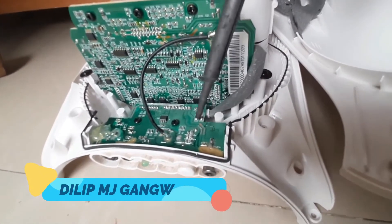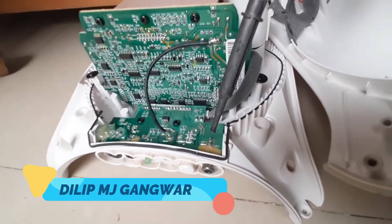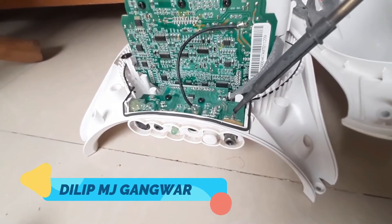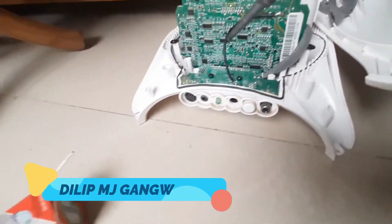You have to be very careful that you do not spoil anything because the soldering iron can be very hot and you can melt the plastic. You can see that I actually tried soldering it before but it did not fix the volume. In these things you always have to check the continuity.